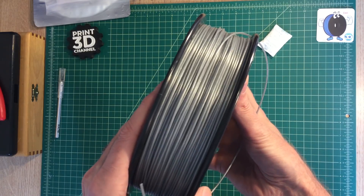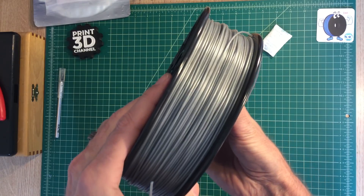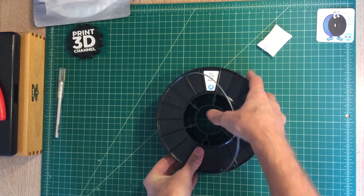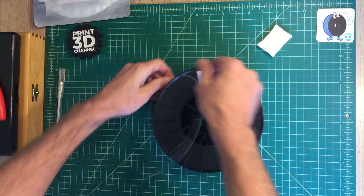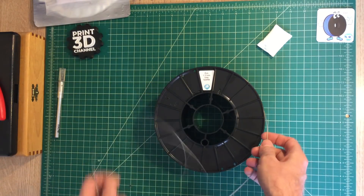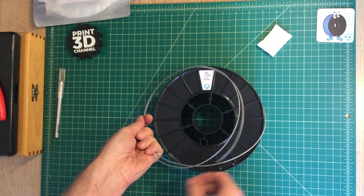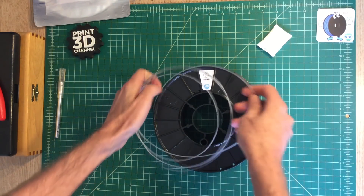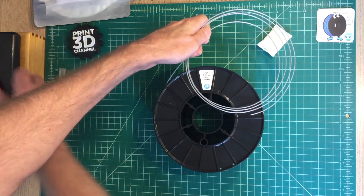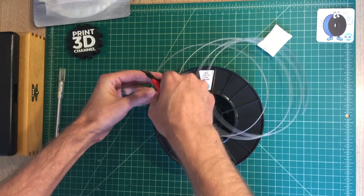Checking out the actual sparkle filament, you can see it's more of a medium sparkle or glitter to the filament — it's not an intense glitter. I'm excited about that because I wanted something a little bit more medium distribution. The first thing we're going to do is unspool a little bit of filament from the roll, clip off a little bit, and do our bend test and clip test to see the consistency and density of the actual filament.